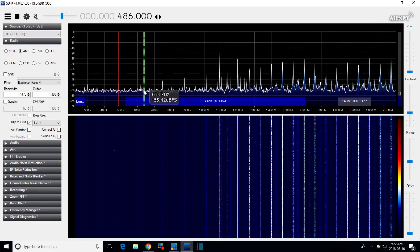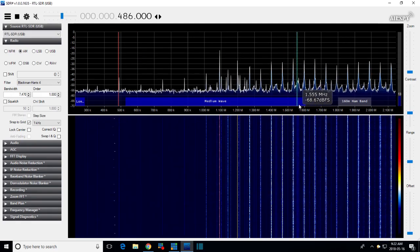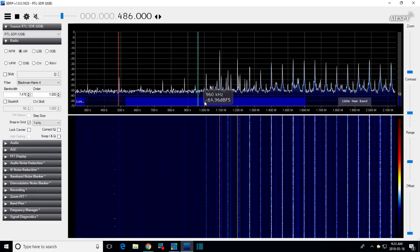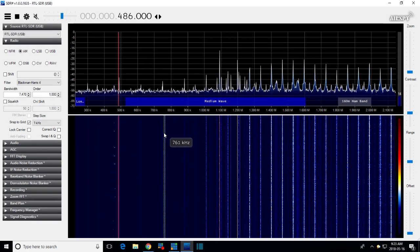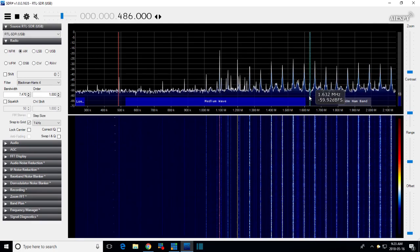The sweep generator is not the smartest instrument in the world. It sweeps from the bottom of the band up. And then it doesn't turn off and sweep back quickly and then come across again. All it does is sweep according to the speed I set, and then it shoots back at maximum speed to here and then sweeps again. So those trips back go right through the tune point and can produce another pip. Sounds like a heartbeat, kind of. Tick thump, tick thump. You know, it's just possible the tick is actually the return.